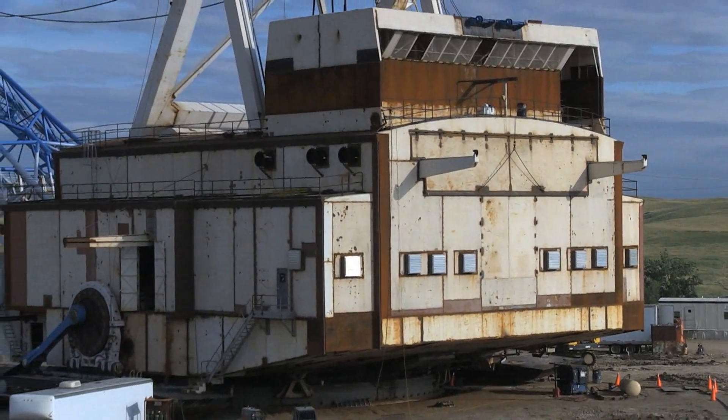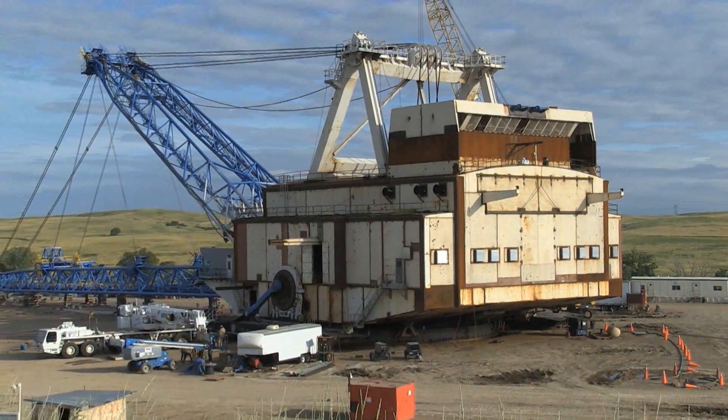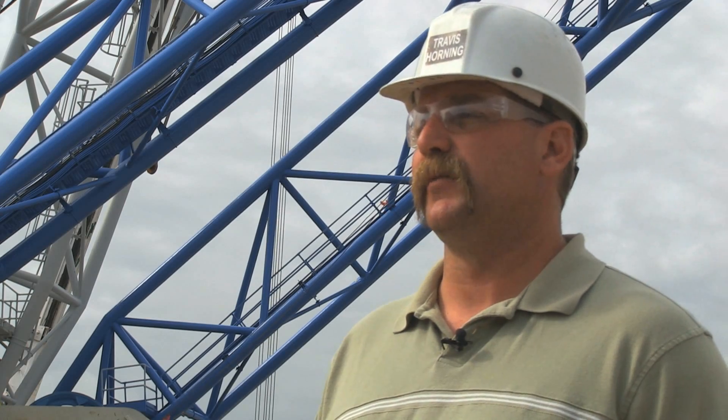They're making sure, first of all, the electrics are running correctly — the MGs — making sure that we have blowers, making sure the motors stay cool while we're raising the boom, making sure the fans all work. And then they're also checking brakes. We've got to check all the brakes, make sure they'll open and they function correctly. And then from there, we're watching pinch points while we're raising the boom.